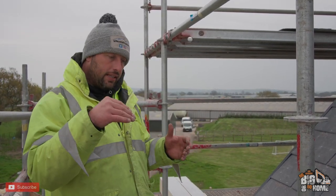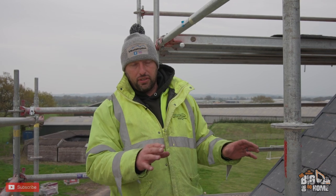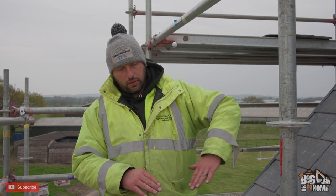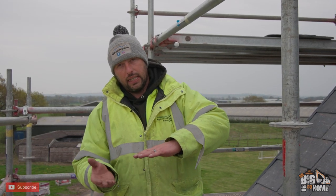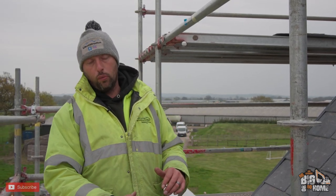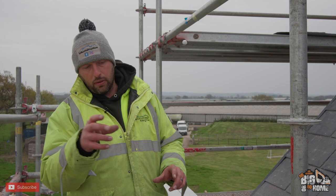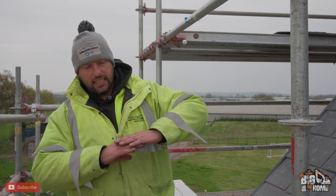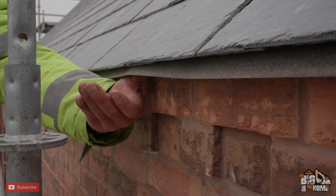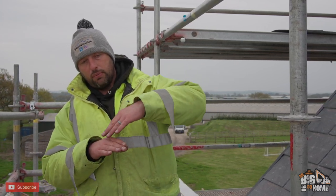The slate goes on and is fixed with copper nails, nailed through to the tiling lath — that's the roof finish. On the eaves where the roof comes down at the bottom, there's a form called a kick, so that bottom tile slightly raises up to keep the pressure on and keep the gap nice and tight at the bottom. Between the slate and the brick corbel we've laid out what's almost like a thick felty material first, which gives a weather seal and flows into the gutter, so any rain coming through those bottom tiles flows onto that and into the gutter.